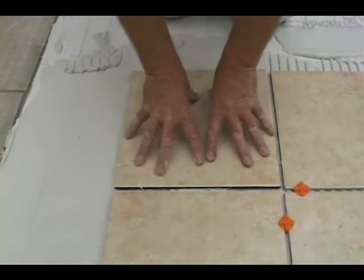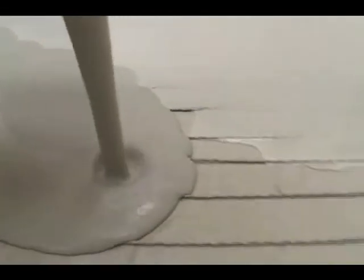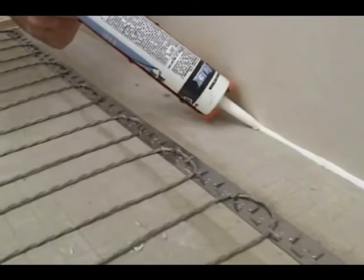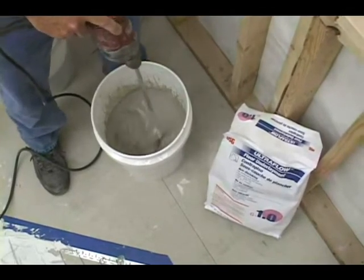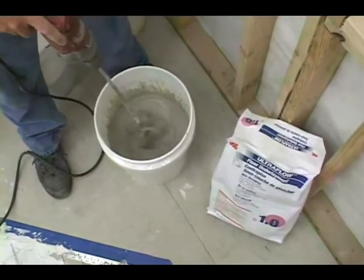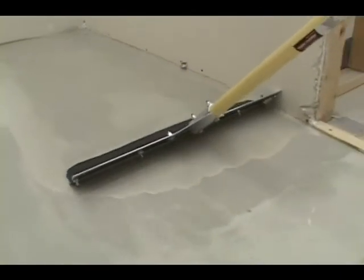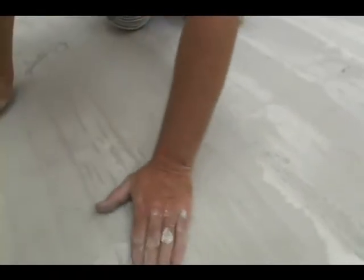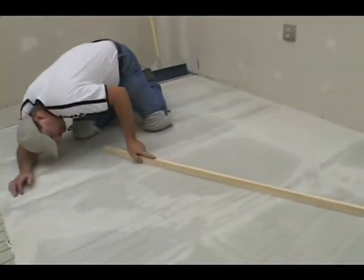Some installers apply the tile while the layer of mortar is still wet. For self-leveling, the material is a concrete compound which finds its own level. The ideal thickness is three-eighths of an inch, although a quarter inch is usually sufficient. First, caulk the gaps along the perimeter of the area to be heated. Then mix the compound according to the manufacturer's instructions — we are using half-bag mixes in five-gallon buckets. You can pull a screed across the surface to make sure the depth is correct. Once the whole area is filled, pull a blade across the surface to remove any air bubbles. The next day, inspect the surface for tabs of mud and remove them. Use a straight edge to make sure there is very little variation of height on the surface.